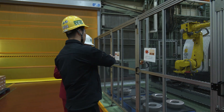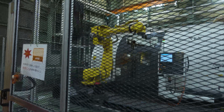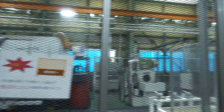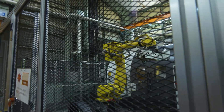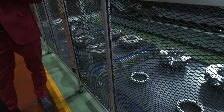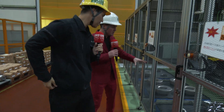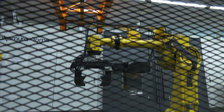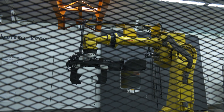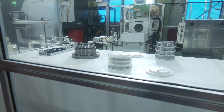So from raw material to complete parts, we have our Super NTX, our product, and one 5-axis machining center from Yasuda-san. So this cell — the robot also from FANUC — has many jobs. Loading material to the NTX, and then after machining, it comes here. So we're starting with the raw material here, utilizing the Nakamura machine with the FANUC robot, doing automation, loading and unloading. Over here it looks like we have some sort of work desk — what's going on? What's the process?